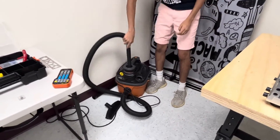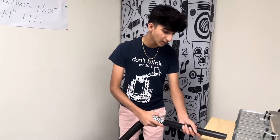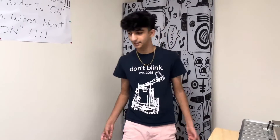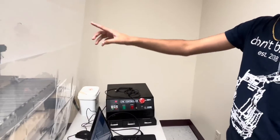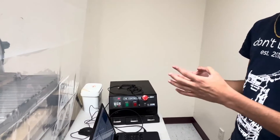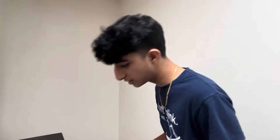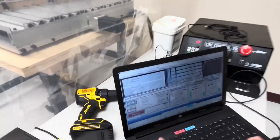Another safety measure is having a vacuum. When cutting parts with pockets, pieces are going to fly out, and while the machine is cutting you have to be very careful — as soon as it cuts the pocket, your vacuum should vacuum it right up. Make sure you have a shop vac, as a regular floor vacuum won't cut it. This red button over here is an emergency stop — if your machine goes too far one way or drills into a screw, you can slam this to stop it, though it will mess up all your zeros. You can also use the stop button in the Mach3 Mill interface to stop the current cut.